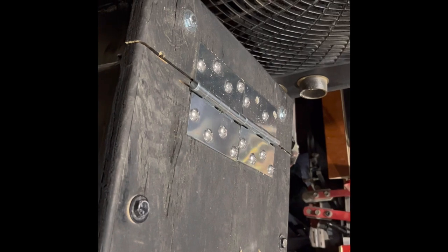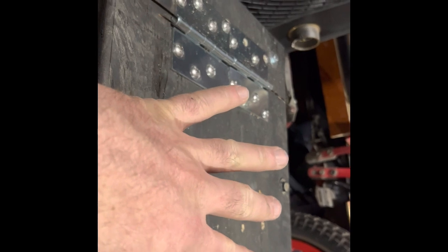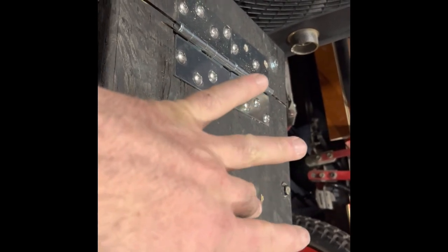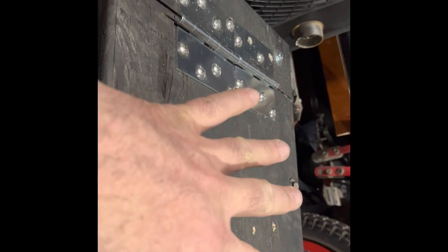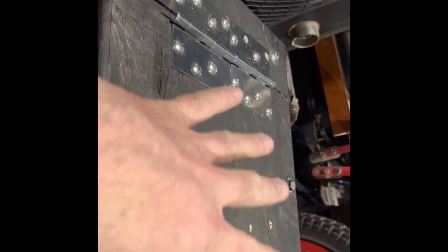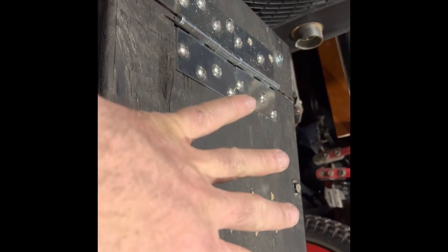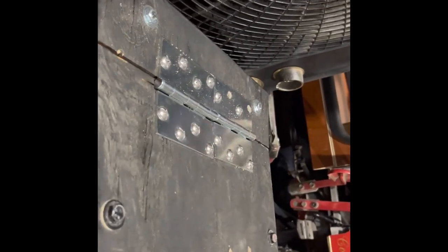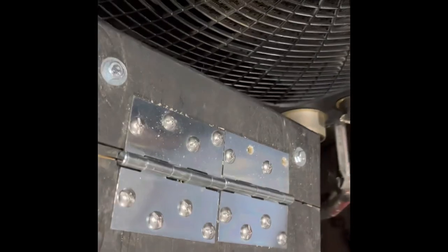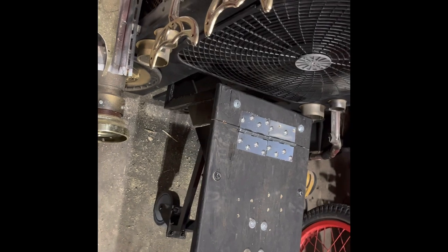But if I were to hit something, there are essentially four sets of wheels: the drive wheels, the coasters in the front and back, and then this is the one I just added. If it was a solid plane, with no room to flex, I could hit something and potentially get stuck where my drive wheel here is off the ground. By this flexing up and down like this, that should solve that.